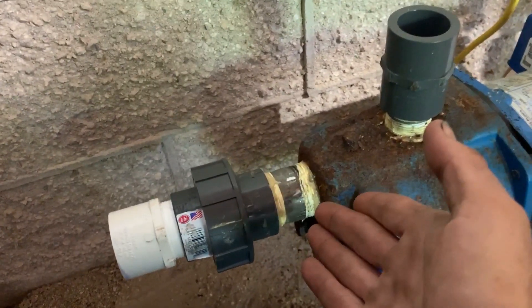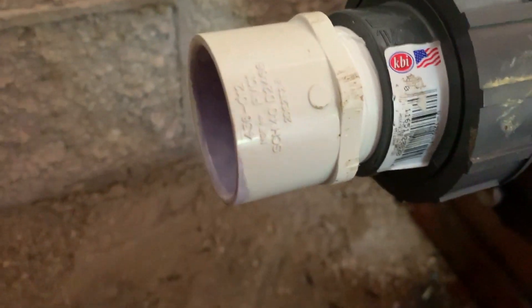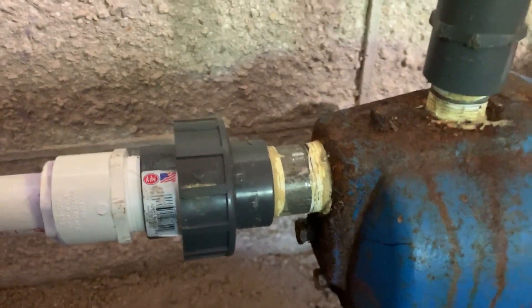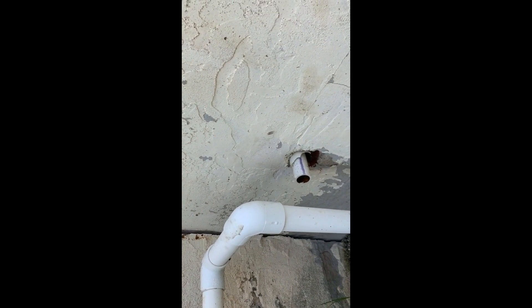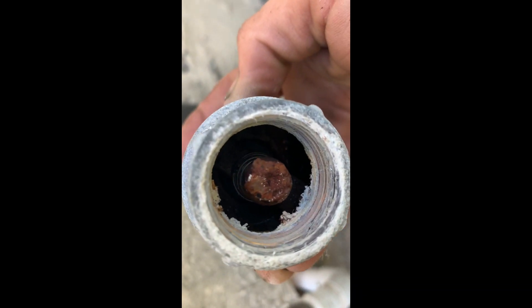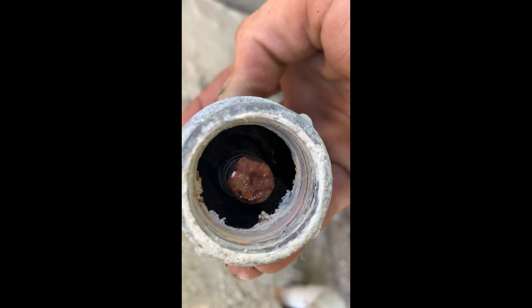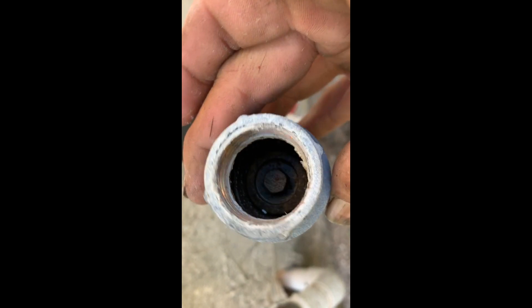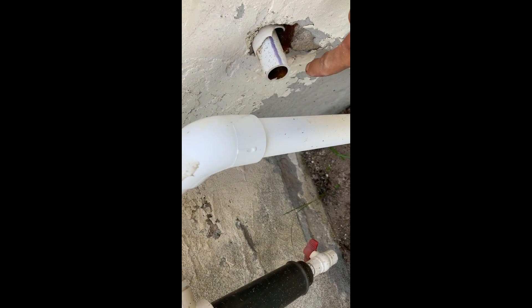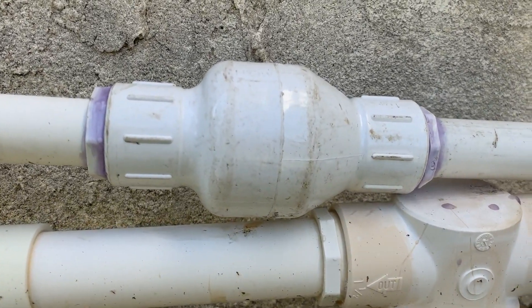You can see our setup now — heat dispersion because of the galvanized nipples. The inch and a quarter coming in, we're going to push this down to one inch to match the pipe coming in from the aerator tank, then complete the gap up here to join the one inch that feeds the house. There is our completed project right there. We also removed the old brass check valve outside — I think it had caused what happened inside too because the spring was sticking shut.